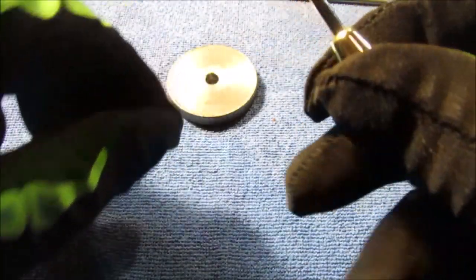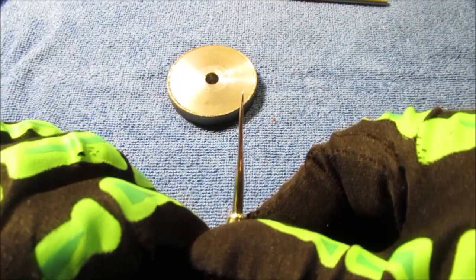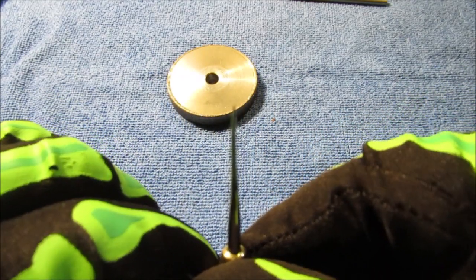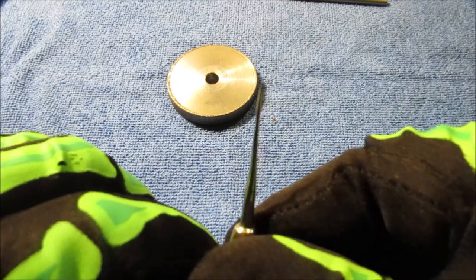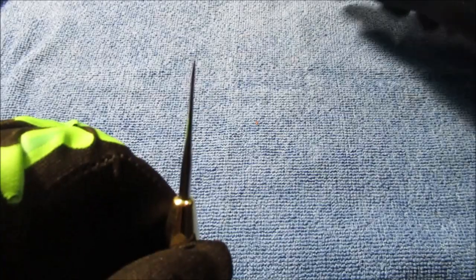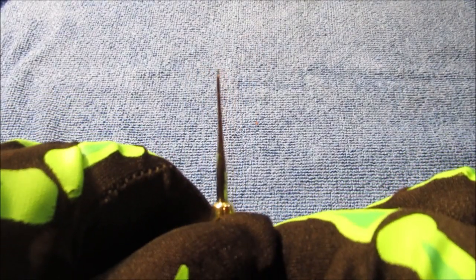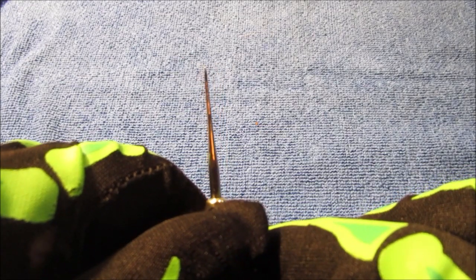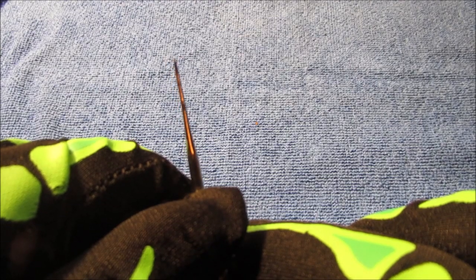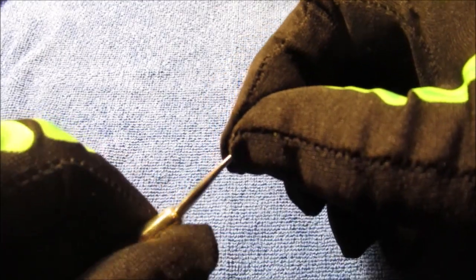But you can measure this down to various thicknesses from 1/8 inch. You can go clear down to like 20 thousandths almost to the tip. I'm trying to take a close-up shot. Get that out of the camera view. You can measure it. I'm trying to get a little shine. It's not a perfect taper, but believe it or not, you can sand this kind of stuff with sandpaper if you want to put the muscle in.